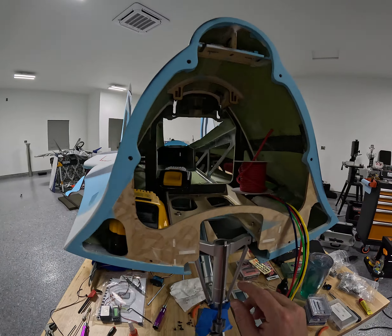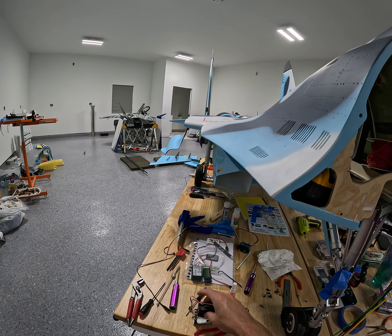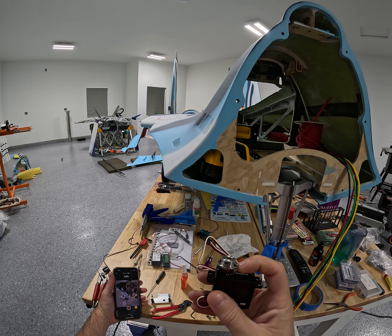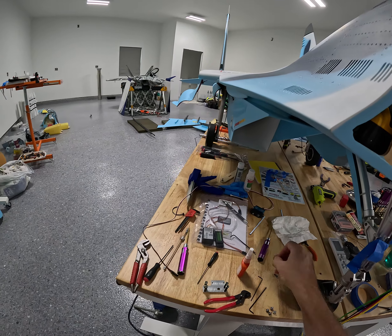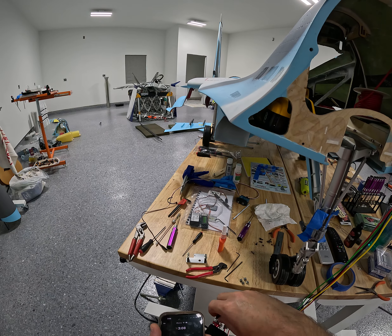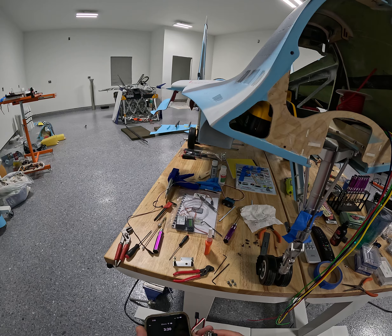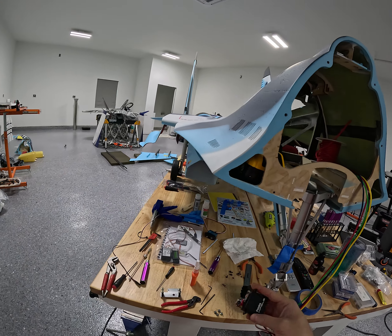I also took this back apart and flattened it a little bit better. I changed out some hardware — I put longer screws so I could put a nut on the back side. I'm also going to replace the set screw with one of these guys right here — I saw issues with the set screws and this will help because I couldn't get it tight like I wanted and I was worried about stripping it. There's plenty of clearance for it.